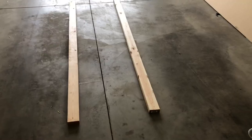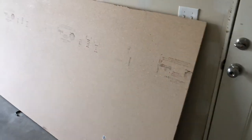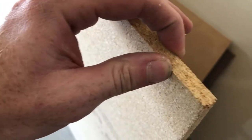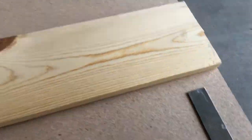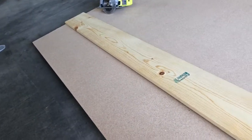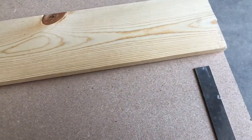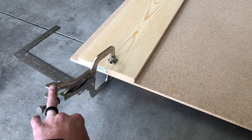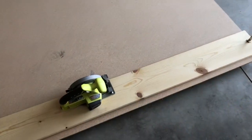Next I'll try to cut my piece of plywood or particle board. I'm using some extra six-foot two-by-fours to lay the sheet down on the ground so I can cut it on the floor, since I don't have a table big enough. It's only about a half inch or quarter inch thick — thin enough that I hope it will bend around the edge of the step. I'm measuring in eight and a half inches from the outside because that's how tall the wood part of my step is going to be.